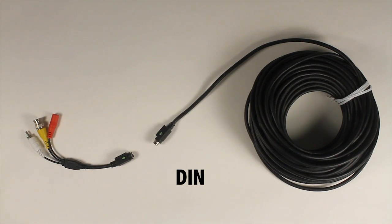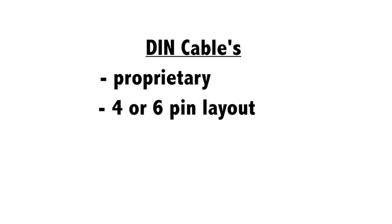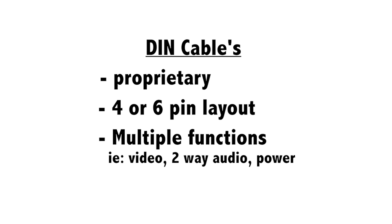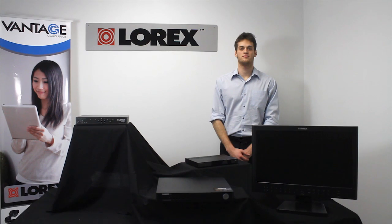The DIN port is used for a DIN connector, which is circular with a pin layout. DIN connectors are generally proprietary and specific to each manufacturer; Lorex DIN connectors have either a 4 or 6 pin layout. The advantage of a DIN connector is that it can provide multiple functionalities through the same cable via the pins — for example, a DIN cable on the camera can be used to provide video, 2-way audio to and from the camera, and power. Lorex provides accessory adapters to connect DIN cameras to BNC ports. That concludes our demonstration of Lorex DVR inputs and outputs.